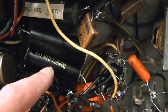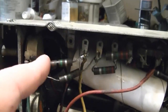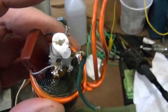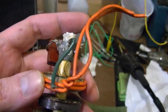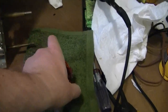According to the schematic it should be .005 at 6,000 volts, although this is a replacement rated at higher voltage. But this thing is huge. With that out of the way, the high voltage coil mounts right there. There are a couple of wires that go over to the socket on the high voltage rectifier — those are the two orange wires — and two wires that go to the primary. There's also one I'm not sure about; it just seems to be a freestanding terminal. And then finally that wire goes to the high voltage rectifier anode cap.